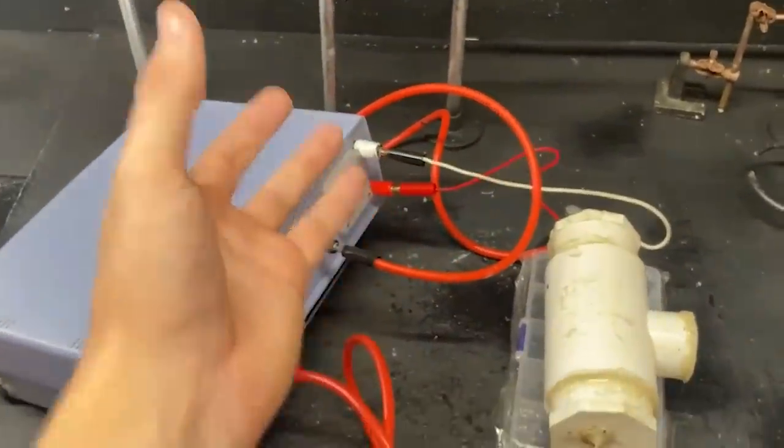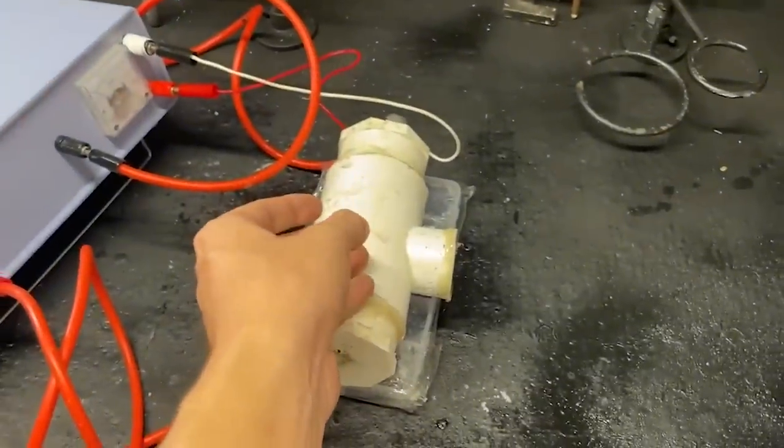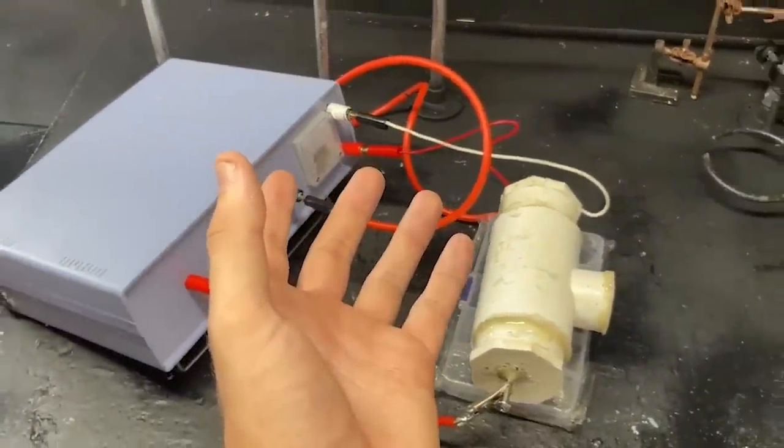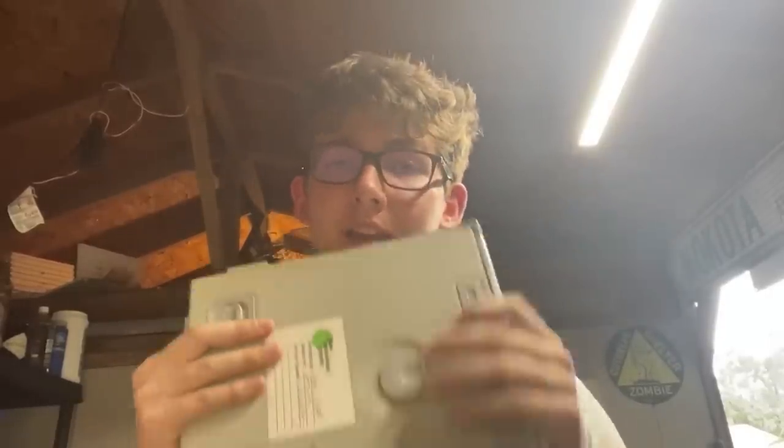Okay, let's go ahead and build this. Here's the setup we're going to use to take each of our individual two-dimensional x-rays — our high voltage DC power supply and our x-ray tube. We're using an x-ray intensifying screen to capture the x-rays. This white screen contains a scintillating compound that emits visible light when struck with radiation, so when we strike it with x-rays we get green visible light out. Things that block x-rays will create a dark spot — bones absorb more x-rays and create a dark spot, while flesh lets more x-rays through giving a brighter spot. All we have to do is point a camera at the screen and take a picture.